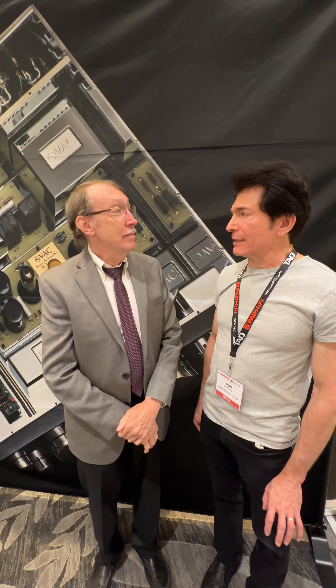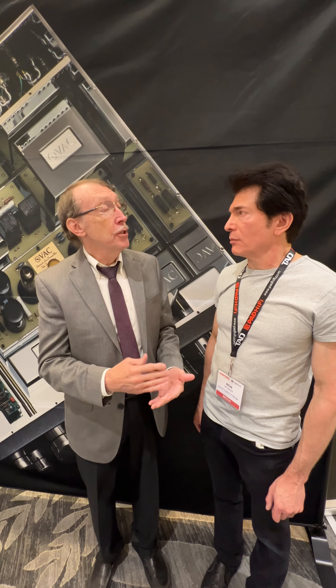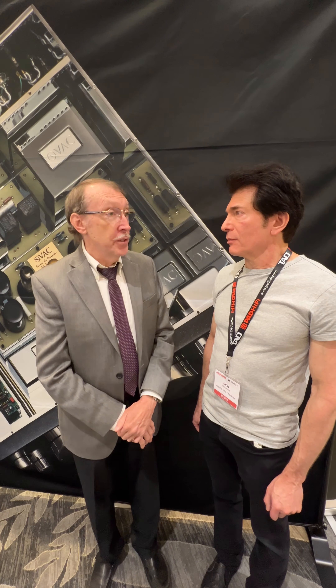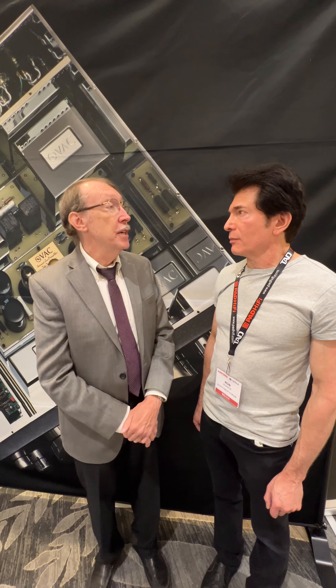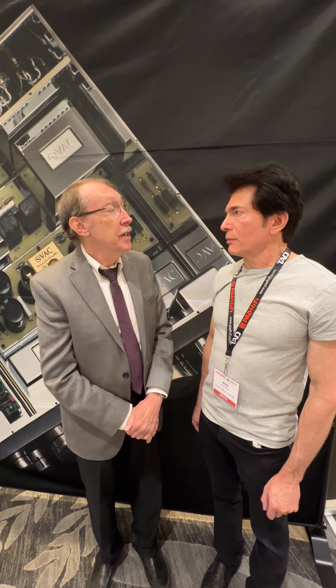How is the Essence 80 biased — manual or automatic biasing? We run with our patented IQ automatic biasing system, which continuously monitors the idle current of the tube and prevents it from drifting upward, which improves reliability, improves the sound, and also makes it essentially a plug-and-play device. It optimizes the tubes continuously and tells you when they're getting weak.